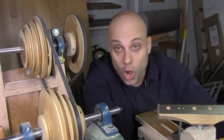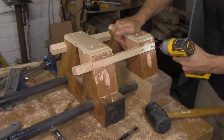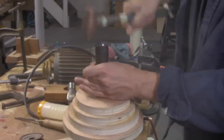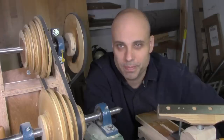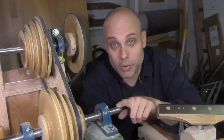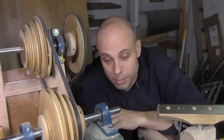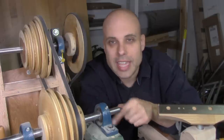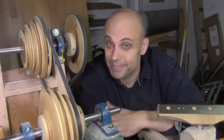It has been a long road. I've spent about six weeks working on the real lathe, and I'm finally at the end — I am ready to turn something. I have this great spindle over here. It's three-quarters of an inch, solid steel, and there's a beautiful 60-degree taper right at the end. The only problem is there's nothing here that's going to actually drive the work, and if I can't drive it, I can't turn it.